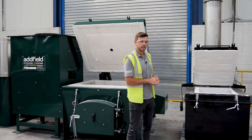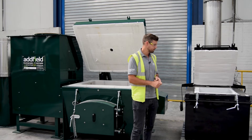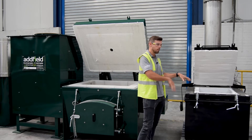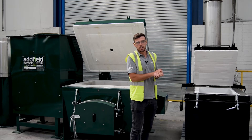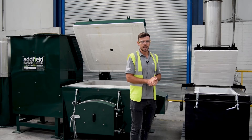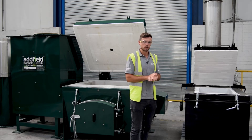So with the A, it's a two-layered system — a board and then a concrete hot face. It's less labour intensive for us to do. We do the mixtures, put our anchors in position, put the mould in, and pour in the concrete. What does that mean to a customer? The concrete isn't cured, so by the time it arrives onto your site, you have to do a dry-out schedule — a controlled ramping temperature to draw the liquids out of the refractory.